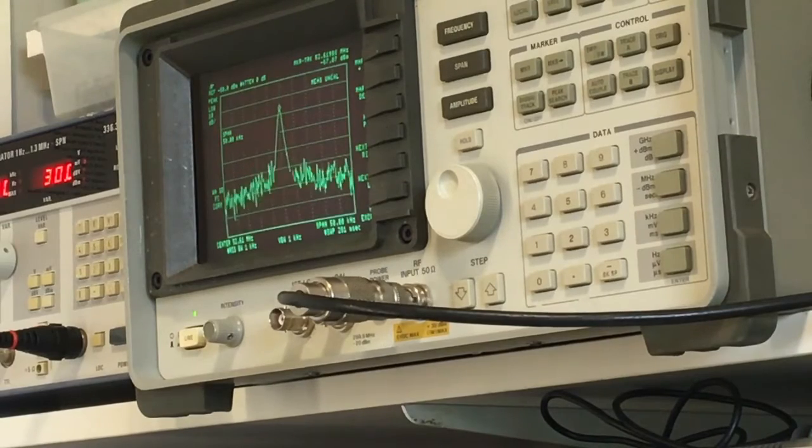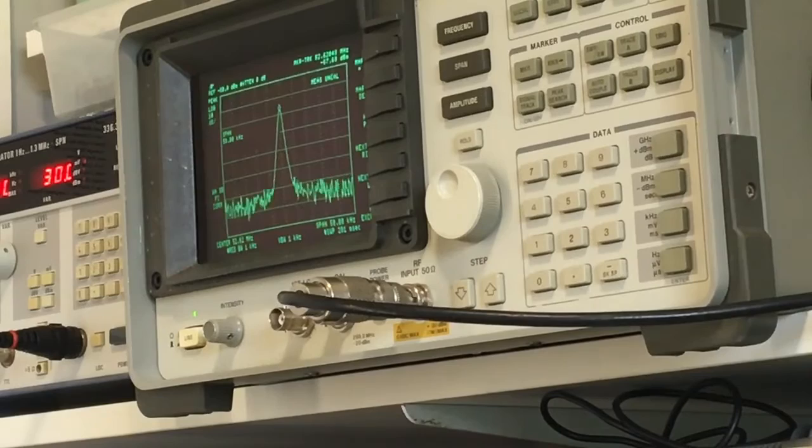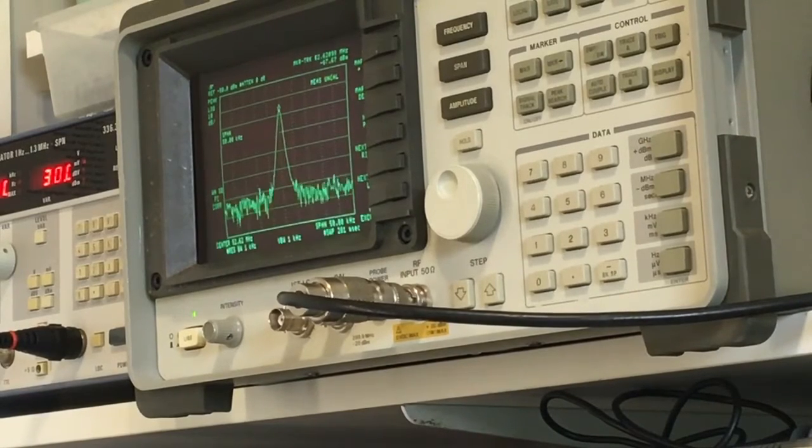Turn it off because it's annoying. So that's the frequency which shouldn't be getting generated. All right, and this is at the original position as set at the factory. So if I then adjust this trap to allow for the new frequency, well, that's seeing it was at minus 68, I think it was, minus 67 dBm.